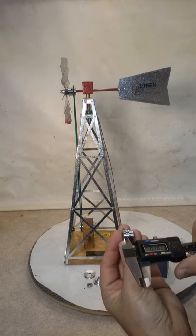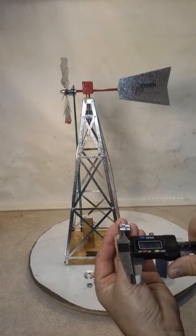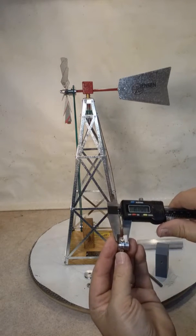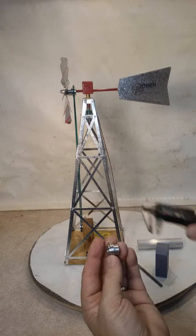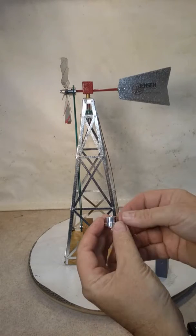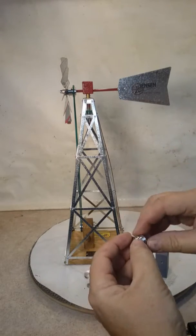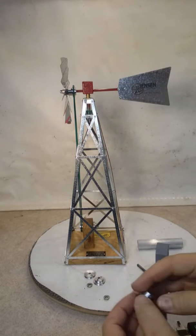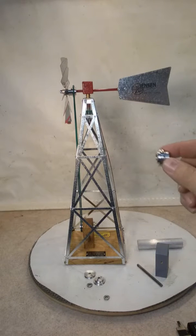And I left just a little bit in front of that groove, and that's about 0.100. The groove is roughly 0.166 wide. And then I put 2 set screws on either side. Of course, this one doesn't have any in it, it's a sample. But that hub is slightly tapered on the back of the fan blade that holds the bearing in it. And so it's good to have 2 set screws so that you can kind of adjust it so it doesn't have a wobbly or egg running effect.